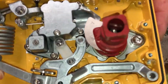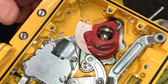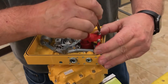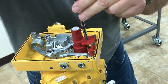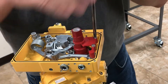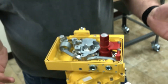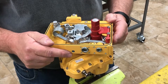As the unit works it's going to follow the cam all the way up and all the way back down. Get your screw good and tight and put your cap back on. There's a range gauge here that shows a total of 90 degrees — zero, 45, and zero — so whether clockwise or anti-clockwise response you can start at zero. There's a little pointer that's totally adjustable; set it on zero and that's it. That's all we've got for replacing the AP positioner — thank you very much.